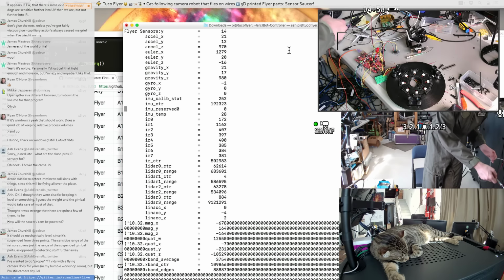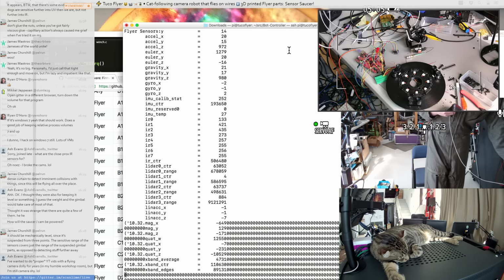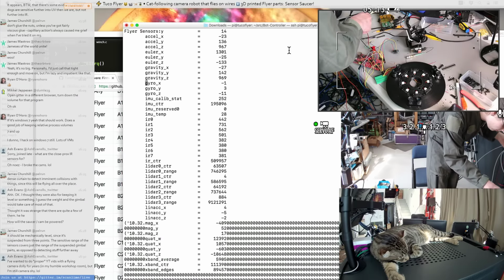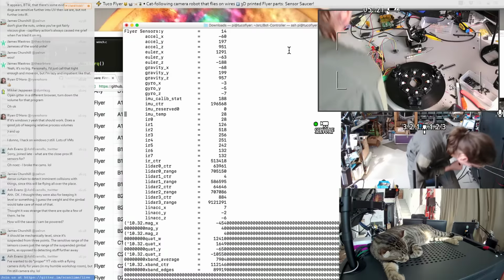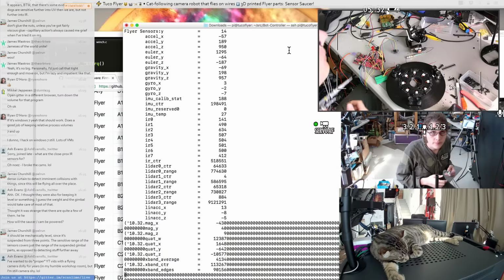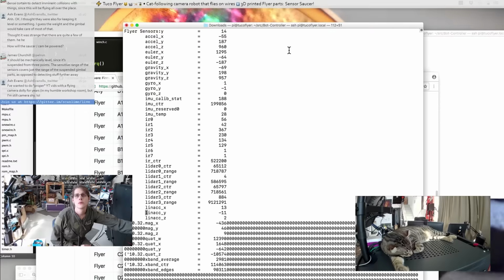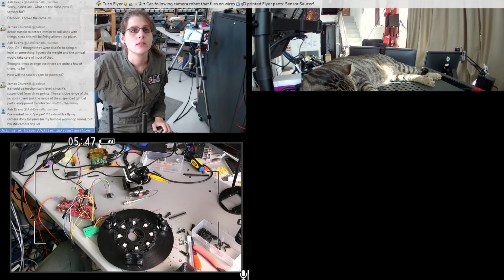And it could be that I just need to make a little circuit board that breaks out the power and maybe also has capacitors or something, depending on how this goes. Probably would not hurt to give these sensors some additional power filtering, because I think they're driving a modulated IR LED, which seems kind of noisy. Oops, let's go... Oh, I'm probably gonna have to reset the O-scope grabber also. Or by reset, I mean momentarily switch to a completely unrelated thing.